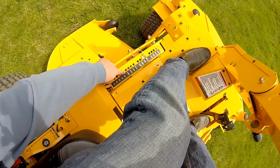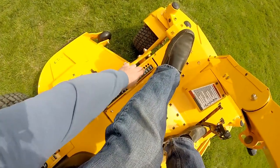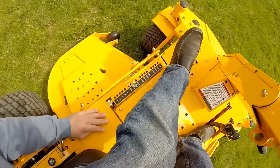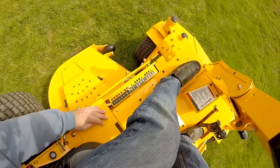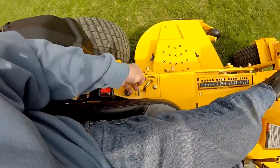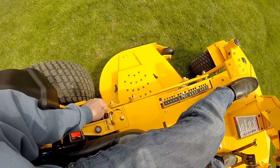Just underneath the left foot pedal are all the different adjustments for your mower deck — one through five inches in quarter-inch increments. To change the deck height setting, press down on the pedal, remove the pin, reset it in a different location, let the pedal down, and you've reset your deck height. If you want to lock the mower deck up in transport lock, press down on the pedal, move the lever to lock transport, release the pedal, and the deck will be locked in its highest position.